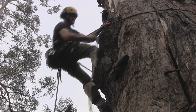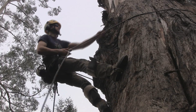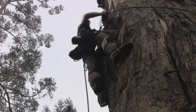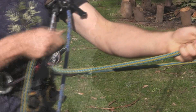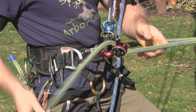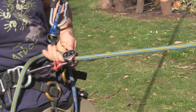Using the alternative type S cam, the positioner can be used on steel core, rope-covered flip lines and pole belts, allowing the same smooth and easy adjustment even under heavy load. The integrated swivel ensures that the positioner is always correctly aligned when taking in or releasing slack with either hand.